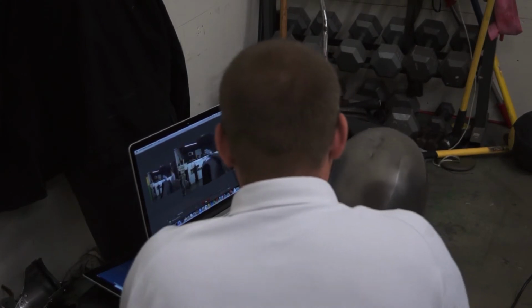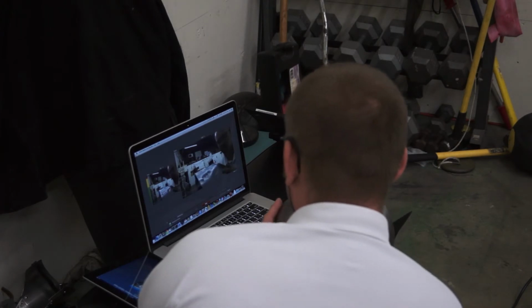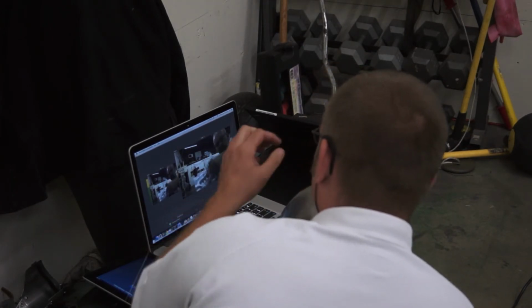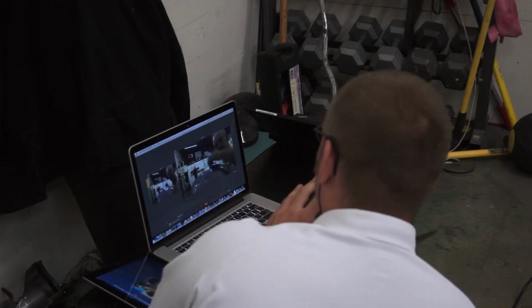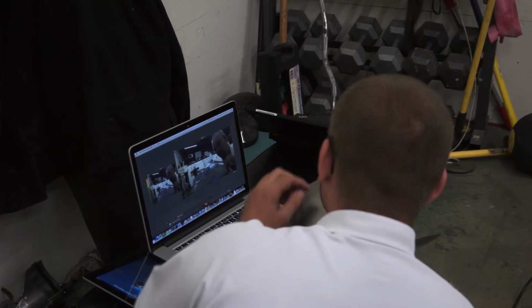But that's 3mm. On the side, again, some more hits. I'll tilt the angle. This is 3mm. We measured this area, and it's pretty much all 3mm. The ridge is up to 5mm with the welding.